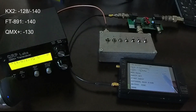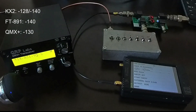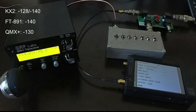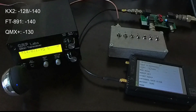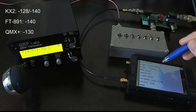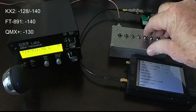I'm going to go through the other bands — I haven't done that yet, but I've got everything set up here. I'm not going to do that on camera, but I'm going to go through 6 to 160 meters and I'll publish those numbers on my website once I get that done. I'm going to call the QMX Plus minus 130, which is about 2 dB better than what the KX2 was without the preamp on. This is my QMX Plus — others will react differently depending on how the coils were wound; others may be better or a little bit worse. But I'm entirely happy with the performance of this radio. 73, thanks for watching.